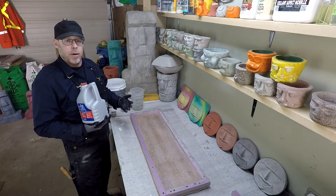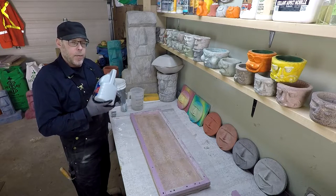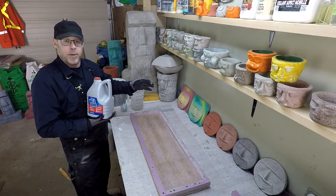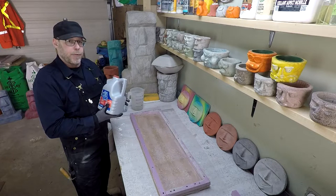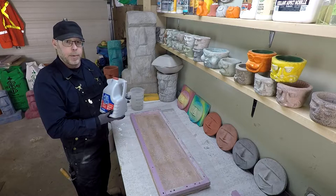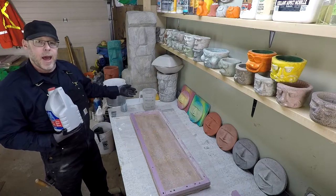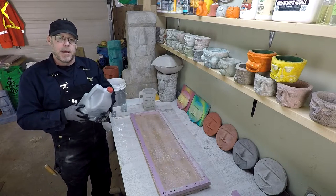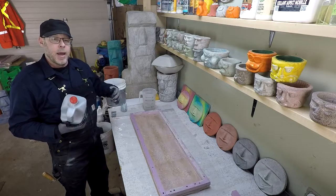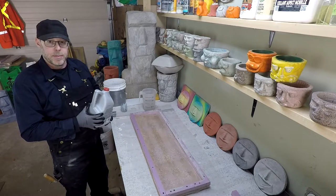However, with a lightweight concrete, the aggregate is going to be very absorbent of this liquid, so I want to use a higher concentration than the 10% that I would use in a normal concrete or full strength mortar mix. I'm going to aim for about 25% of my liquid content to be a liquid PVA product. In this case, I've got this pitcher of water that has about 1.5 liters of water in it. I'm going to add some PVA until it's about 2 liters, swirl it together so it's all nice and mixed up, and then use that to make my 4:1 perlite concrete mix.